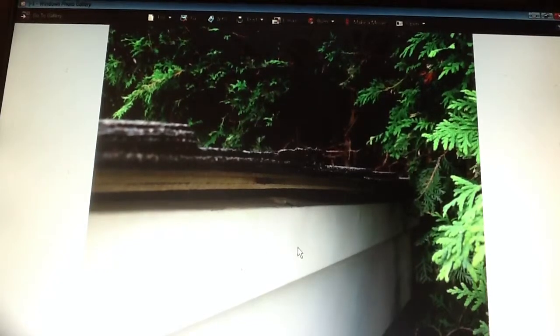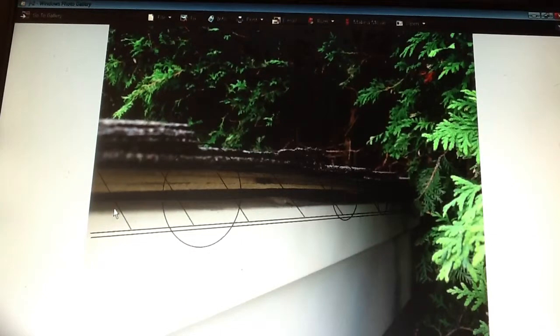I don't know if this is metal in here, wood. I can't tell from the picture that you provided. It looks like there's some metal bent up here. It's really, really hard, so I'm going to try to answer this to the best of my abilities with the pictures that I have. Typically, when you would do a roof, if it's nailed down properly, I took the liberty of filling in kind of what the drip edge would do here. These lines show what the drip edge would cover and down onto this shingle molding or fascia or barge rafter or whatever you want to call it.